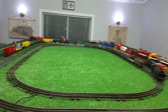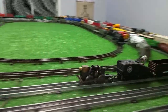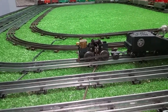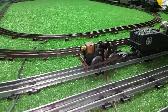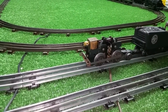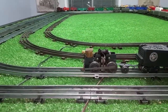It's almost impossible to troubleshoot that without a meter. Trying to troubleshoot it by running it, you will never solve the problem. It was either a bad solder joint, a cold solder joint, or a broken solder joint — hard to tell. You couldn't physically tell by looking at it that the solder joint was bad. I just went around each solder joint, added just a small bit of solder to it, and that fixed it. The coils should read 1.1 ohms across the coil itself.